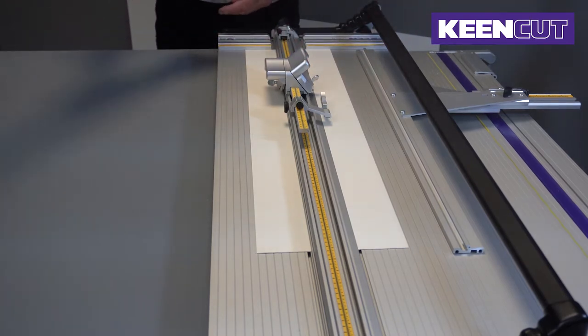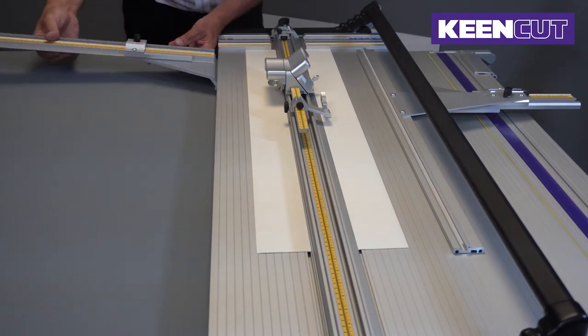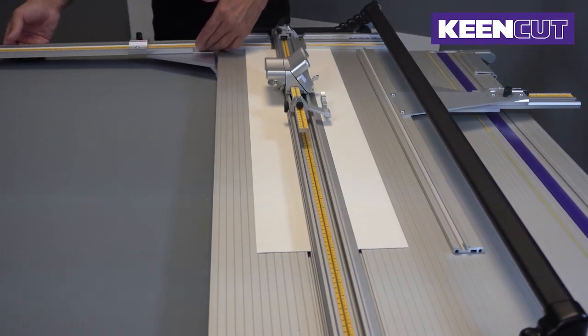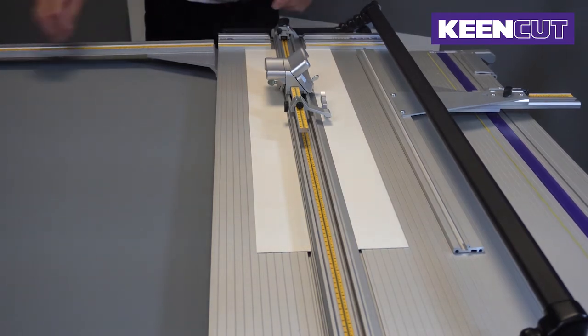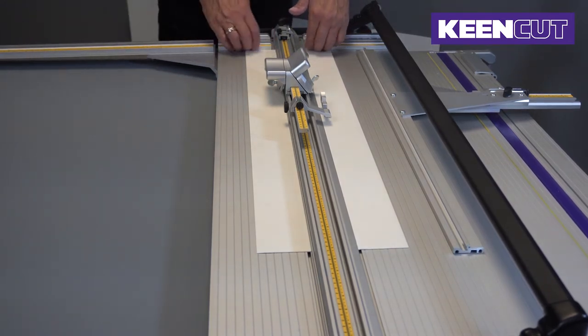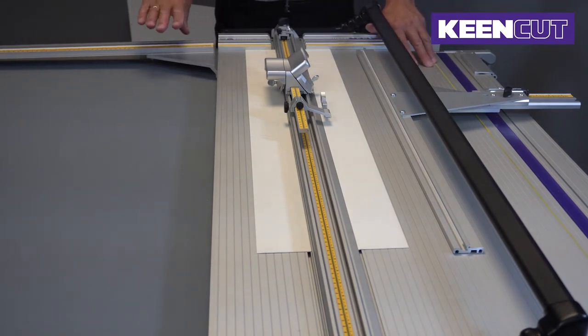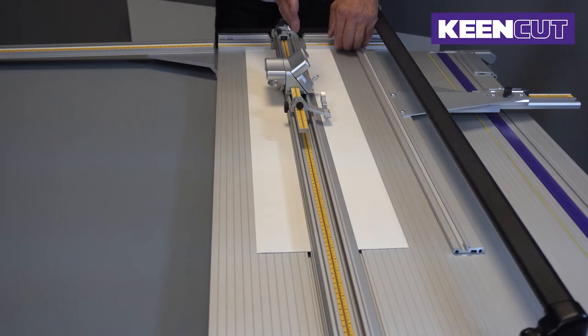There's also the squaring arm. This again clips at 45 degrees — hinge it down, allow it to drop, then slide it all the way towards you, and that should bring the squaring arm and the end plate in line with each other. This is where the material sits. The 90-degree setting of the squaring arm and end plate relative to the slideway is again set up in the factory.